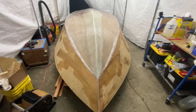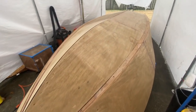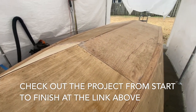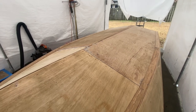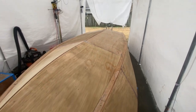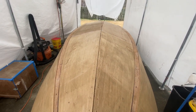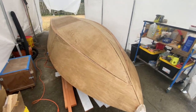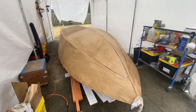In all seriousness it turned out great. This will be the last time you can see the hull without glass on it. I'm going to start getting in here — one of the last things to do is to completely sand the hull to get all these blemishes off. I'm going to take my little orbital sander and run over the whole thing pretty quick just to make sure we've got a good base. Then I'm going to make a bunch of thick epoxy and fill up all this stuff, and then we're going to start laying glass. I've got it all cut — it's going to be an all-day project.